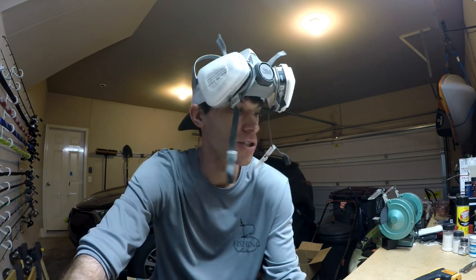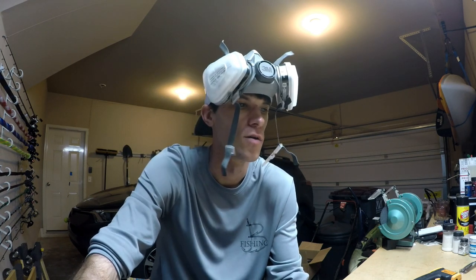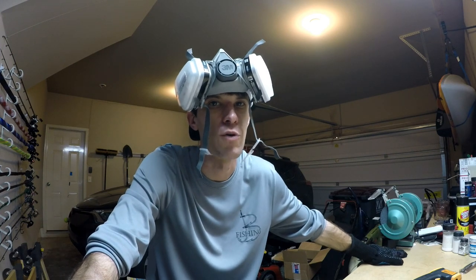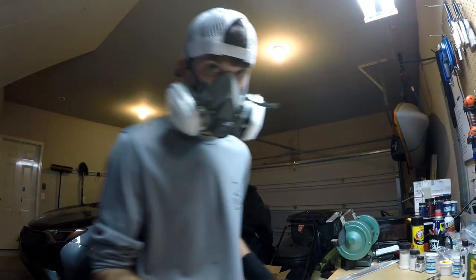You might be asking yourself why 350 — why is 350 the magic number? I probably won't shoot it at 350; I'll actually put it in the injector and into the molds where it's right around 300. But at 350 there's a chemical reaction that happens that really lets that stuff set. If you don't get it to a full 350, it's going to be a little runny, a little sticky — it just will never completely cure into that traditional soft plastic feel. So 350 is the magic number in my opinion on Dead On. A lot of guys go 375 or 400 — you're burning it, so don't ever go 400. Once I hit 350 it should all be cured and I can back it down and maintain shooting consistency right around 300.